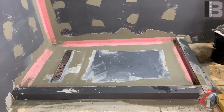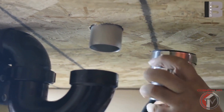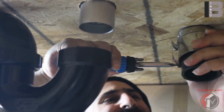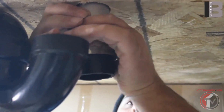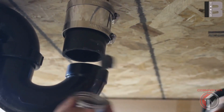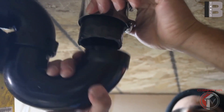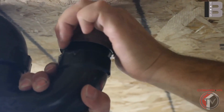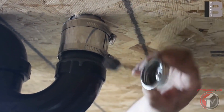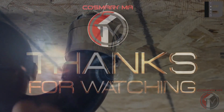Wait 10 to 12 hours and then you are ready to tile. In the meantime, we can connect the drain to a P-trap or U-trap by using a 1.5 to 2-inch drain adapter. The 1.5-inch end goes to the drain pipe outlet and the 2-inch part goes to the P-trap. Make sure all the parts are sealed and glued properly. All done — you are ready for tile!